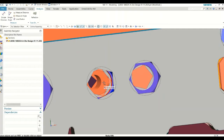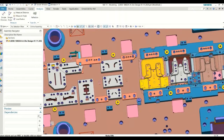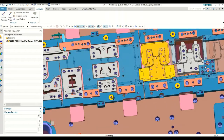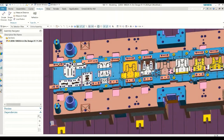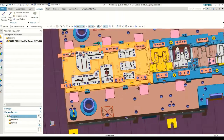This is known as a locking hole. If it is not there, chances are the dowel might get loosened at some point and come out. But because of this locking hole, it will never fall down. We use the pad push-out here, and balancing blocks here to balance the upper pad, because the force will be different in different areas and the pad might get tilted. This is what balances the pad — it's also known as a pad balancer. The lifter plate has four lifting holes as you can see.